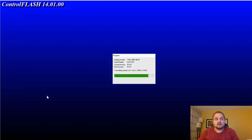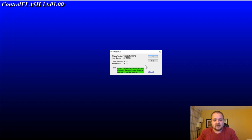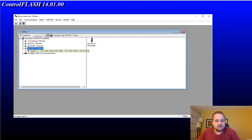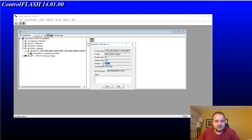This only took a couple of minutes. As you can see, there is a green confirmation message that says: 'Update is complete. Please verify the new firmware update before using the target device in its intended application.' We hit OK, which brings us back to the ControlFLASH main screen. Going back into RSLinx, opening the application, browsing through the same driver as before — the device kept its IP address — and going into Device Properties confirms the new revision is 30.011.